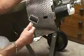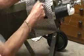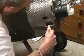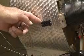After you get it applied and you think it's in the right place, I use this linoleum roller to make sure to get all the air bubbles out. And this roller is going to help me deform the metal around this little edge here where it's causing some problems. Okay, the panel is on, the switch harness is installed and screwed in place, and I added a little bit of super glue, just whipped it into the slot here to make sure it doesn't ever start peeling when the airplane is sitting out in the sun.